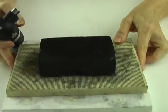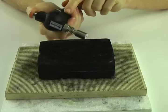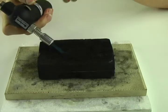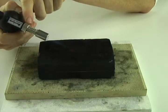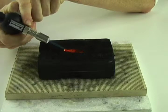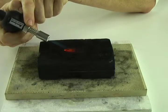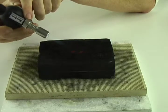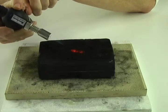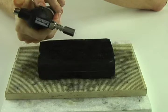I'll show you how we use this. You want to pull down on the lock, press the igniter, and lock the flame on — and you can see the flame here. There's an adjustment here; this little part rolls so that you can adjust more or less oxygen and get a different type of flame. I'm going to open this up further and get more of an oxidizing flame, and then I can turn the gas adjustment down. To turn it off, you just press the igniter button again and it automatically shuts off.